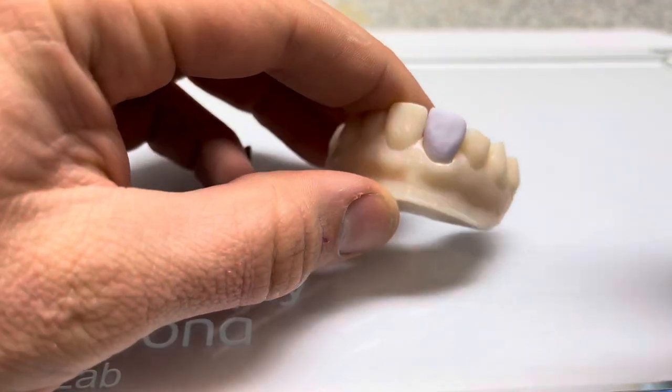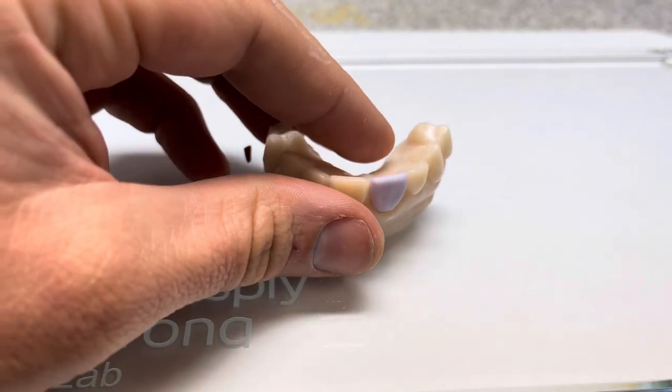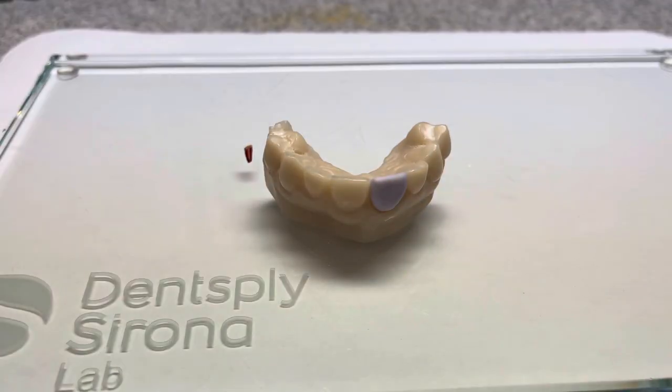What I'm going to do first is take my red pencil. I'm going to use a 25 blade to sharpen my pencil really quick here. We want to mark off some areas on this crown where we want to remove a little bit of material.